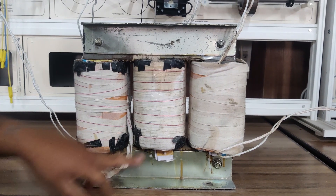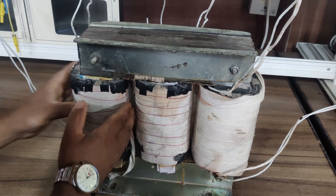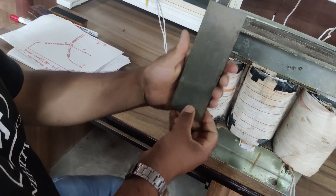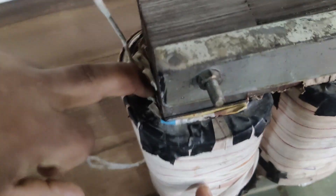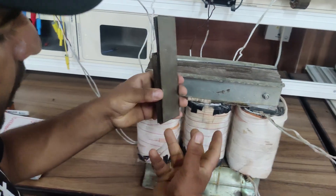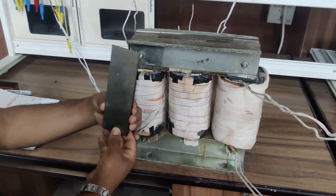The visible things I am having here: this is winding one, this is winding two — in other words, this is phase one, this is phase two, this is phase three. These windings are actually wound on a limb. You can see in my hand this is actually the core which is in laminated form — we call this the limb upon which we wound the winding. We are having three windings, meaning there are three limbs. This is not a solid section; to avoid eddy current losses we laminate the core, and depending upon the given parameters we set the limb size — the length and the breadth.